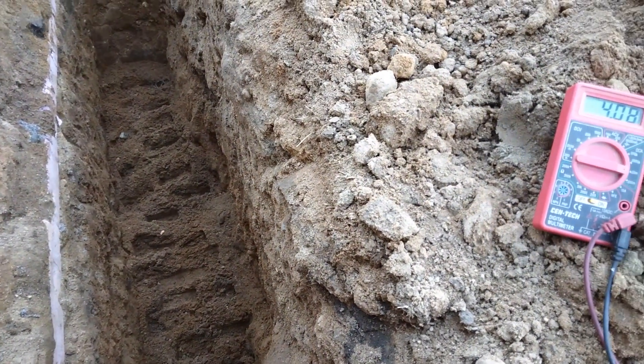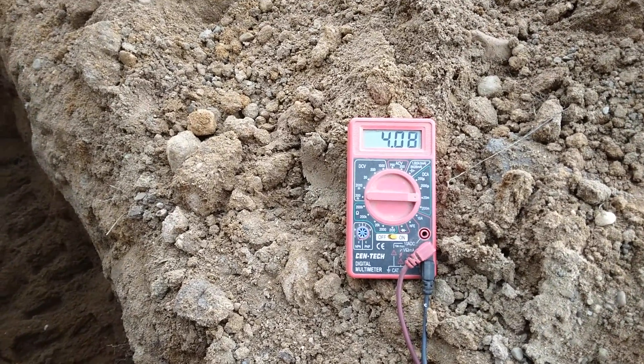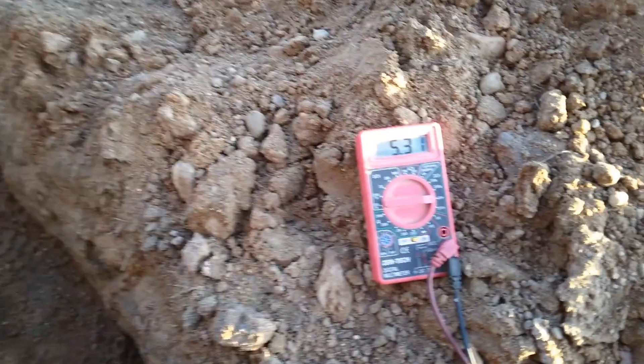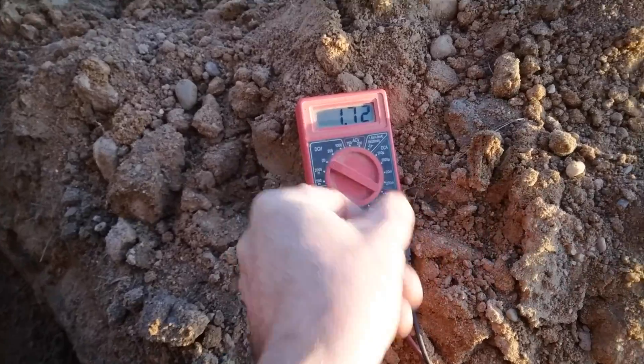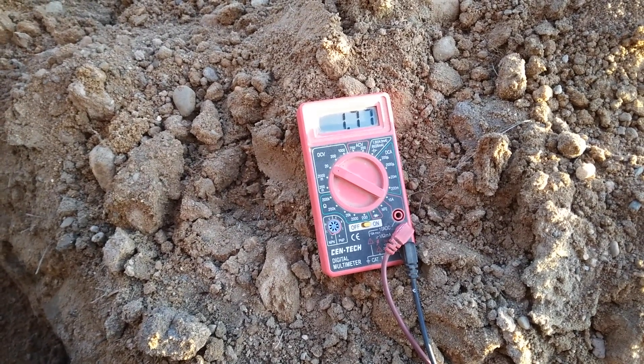I filled it in just a little bit more. Maybe I just need to let some time go by — it might take a while for everything to get set and get some good reactions going with any electrolyte that's in there. About another hour has gone by and the milliamps jumped up to 5.31. The voltage is inching its way up to 1.8 like it was before. After sitting overnight, the voltage came back up to 1.8 volts and the current came up to a little over 6 milliamps.